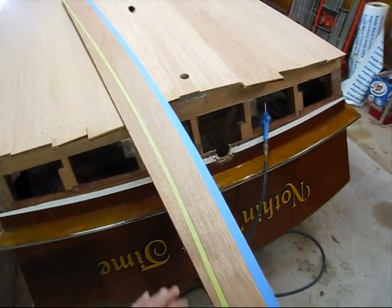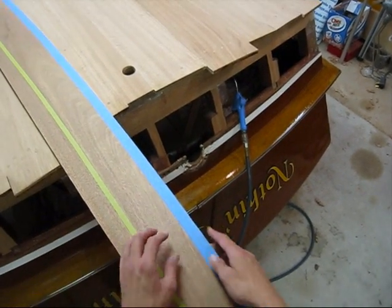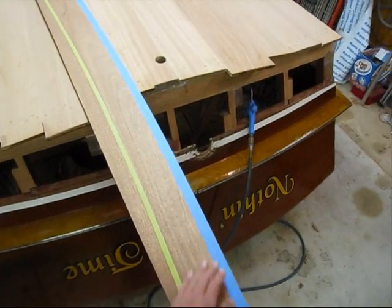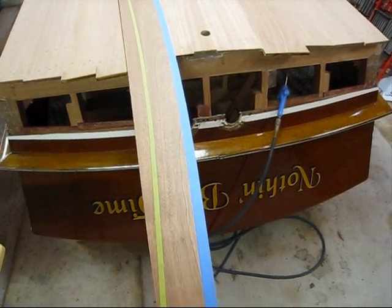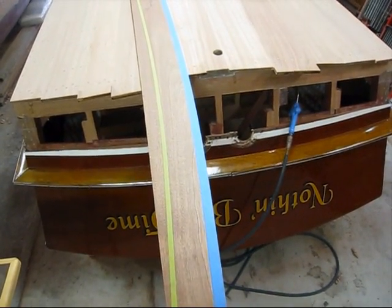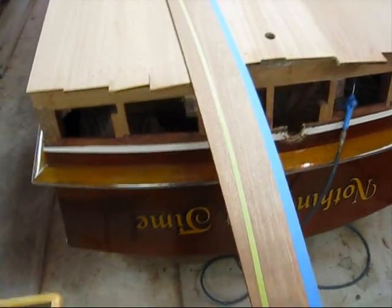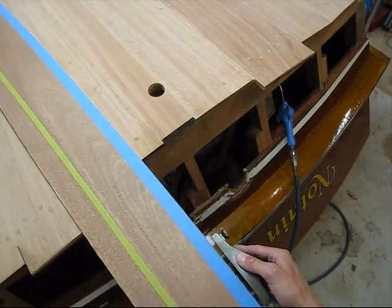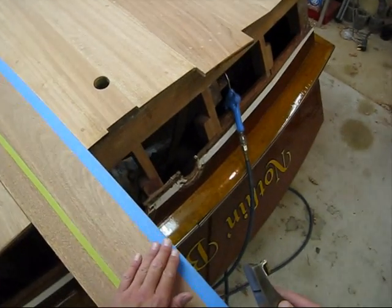What I do is I took the old plank that I'm replacing, laid it on here, traced out the boundaries, and this is the edge I'm going to fit first. With a pencil line I'll do that, and then I'll take some blue tape and run it on there — it's easier for me to see, and if there's any dips or humps in that arc I can straighten it out with the tape. Then I'll run it through the band saw, just proud, and take my low-angle block plane — this is a Stanley 60-and-a-half — and work that material down just proud of the line.